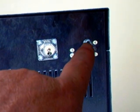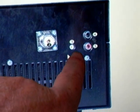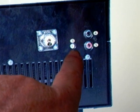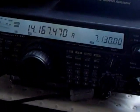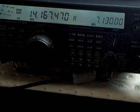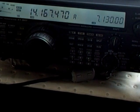The only thing you need to do is make sure you've got the ALC and the standby leads connected — ALC at the top, standby at the bottom. Just to the side is the ALC trimmer. With the ALC trimmer, all you're actually doing is loading from your radio 8 to 10 watts. The manual says 100 watts or full power, but I'd suggest 8 to 10 watts.